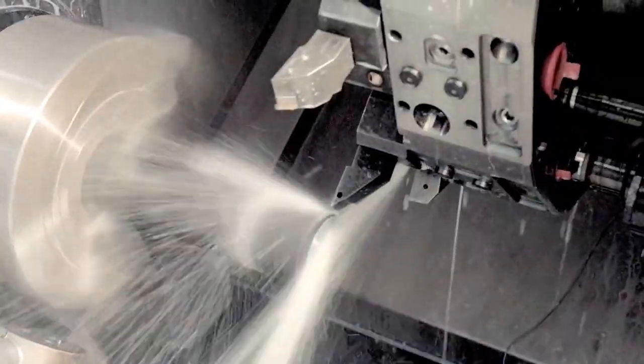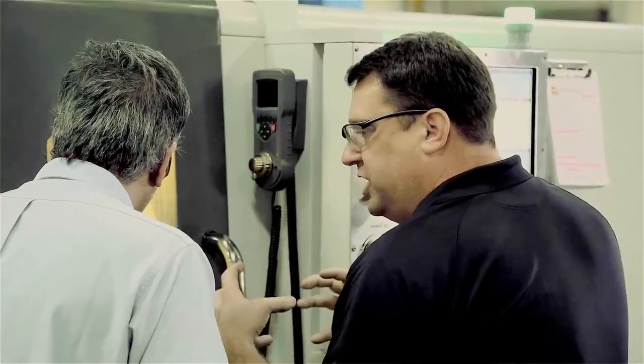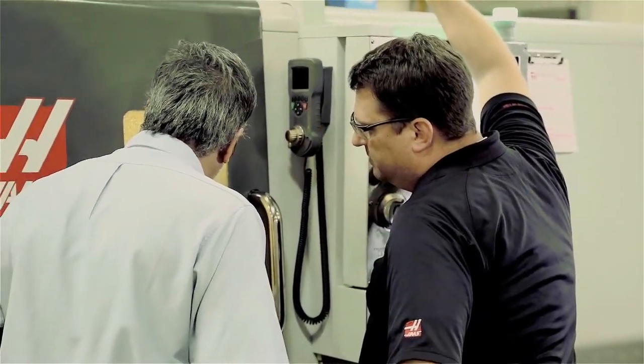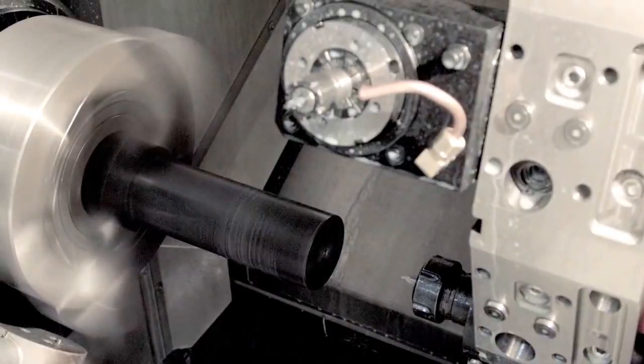You can see where we're still moving and the turret's uncoupled. Correct. That splash of coolant is an indication where the turret's actually uncoupled — uncoupled already before the actual home position is reached. And you can see the clearance that we need. It's very, very close, the index to the pad, but it is safe.